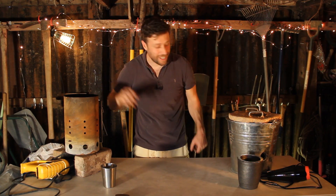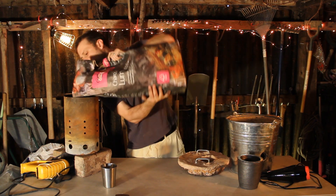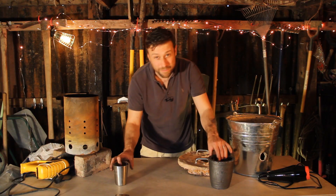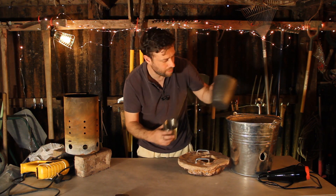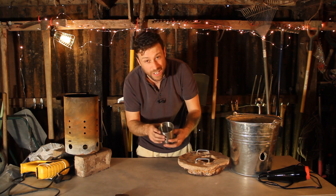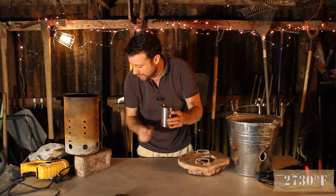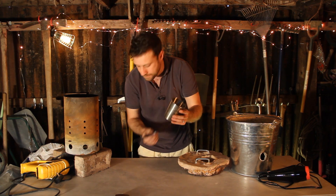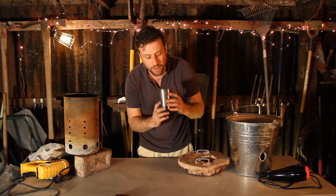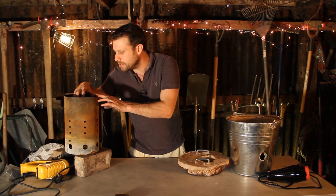We have the barbecue starter here and the furnace that we've just built here. To set these up, we want a bed of charcoal in the base. Then we need a crucible — it could be a purpose-built ceramic one, or just something made out of steel like this cup. Steel is an excellent choice because these furnaces working on charcoal will get a maximum temperature of about 1200 degrees C, and steel won't melt until 1500 degrees C. You can check if it's steel with a magnet — if it's magnetic, it's most likely steel. Some stainless steels aren't magnetic, but as long as you know it's stainless steel you can use it. So we put the crucible in the middle and then build up about halfway up it with charcoal.